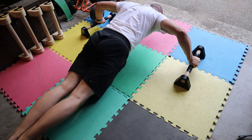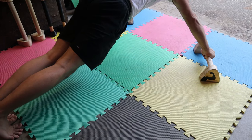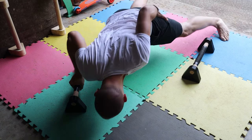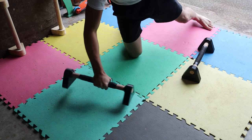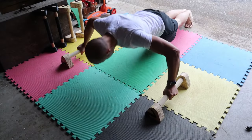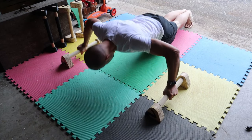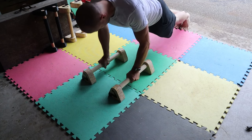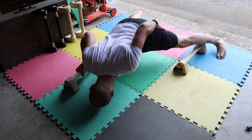As far as looks go, both look pretty good — the plastic version looks a little more professional but the wood one isn't far off. They're both more than strong enough to withstand well beyond the heaviest loads that can be applied. For comfort, the plastic version with the wraps feels a little better on the hand, but without the wraps the larger dowel is better. I believe both will last a really long time. The plastic one has the potential to loosen up over time if the dowels aren't properly dried, but it really shouldn't be a problem with store-bought dowels. Each end takes about 300 grams of filament, so they cost over $20 just for the ends and another $10 or so for the dowel. If you don't have woodworking tools the plastic version is a really good option — all parts are available on Thingiverse. If you do have the tools, the wood version will be cheaper and pretty quick to make.